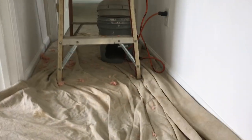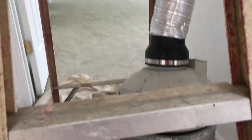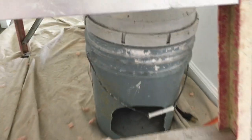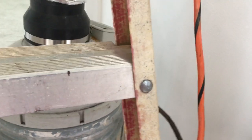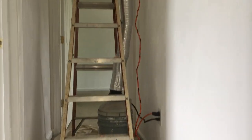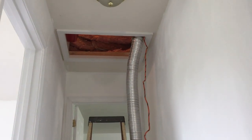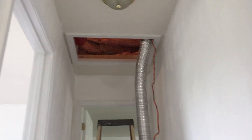That's a five gallon bucket there, hollowed out — that's going to move air for us. This is a repurposed old radon fan that fits perfect on this bucket like it's made for it. Wire it in, plug it in, and we'll fire it up. That's moving nice air-conditioned air up this rigid dryer duct up into the attic.